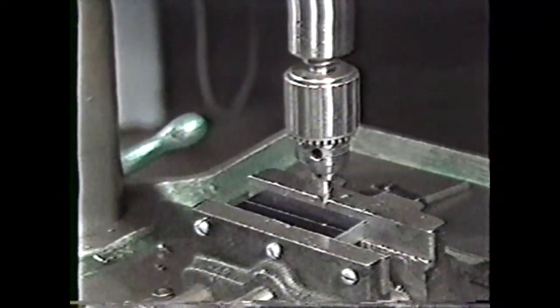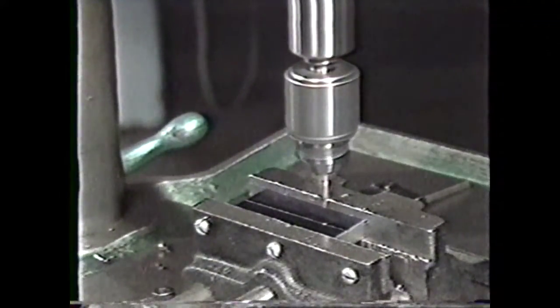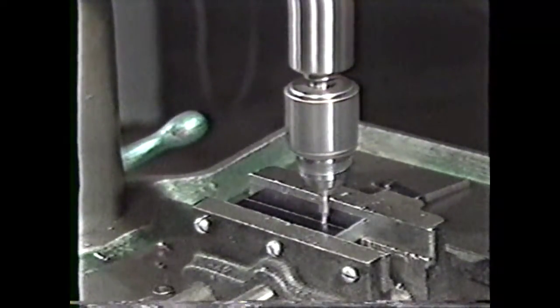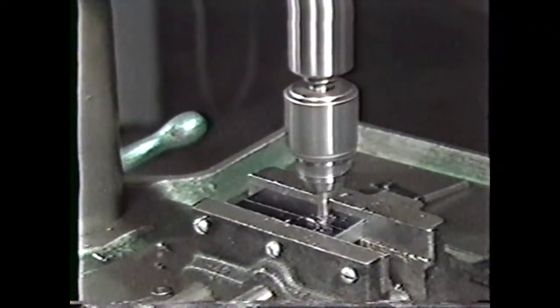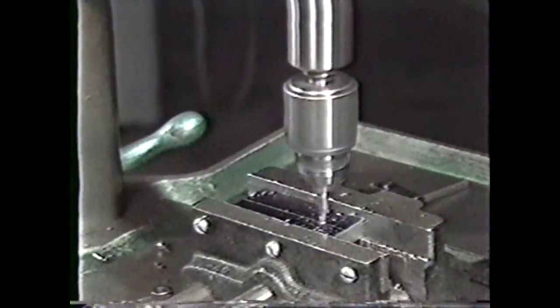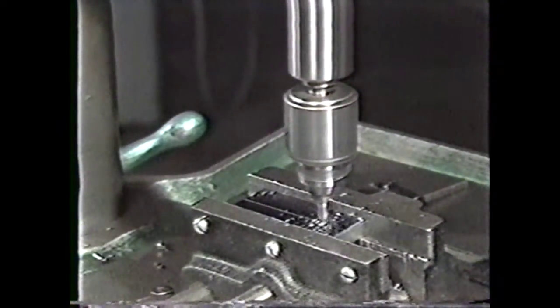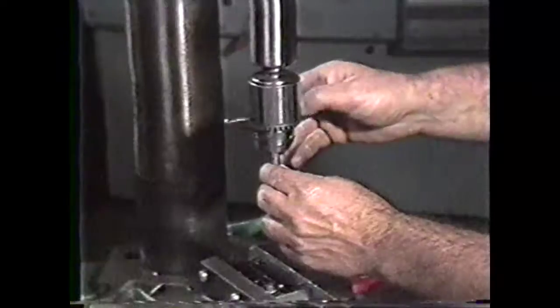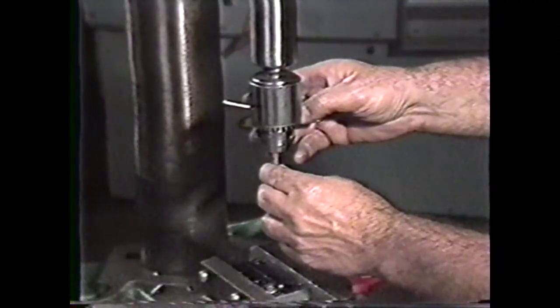Turn on the machine and center drill the hole. You center drill with a combination countersink and center drill before drilling the hole. This prevents the drill from traveling and missing the true center of the hole. When you have completed the center drilling, shut off the machine. Remove the center drill